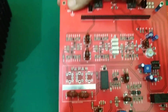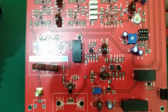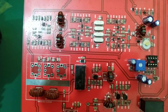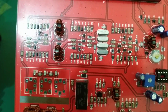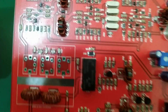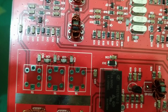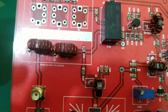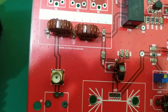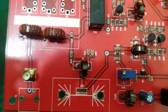Some components are not yet mounted — the TL071 is missing here. The board is made so that anyone can understand which stage is which, because there is enough space on the PCB; it's not cramped. This is the band-pass filter — I haven't mounted the coils yet, but the SMT caps are in place. This section is the low-pass filter, and we have a BNC and SMA connector for the antenna, plus an IRF final transistor.